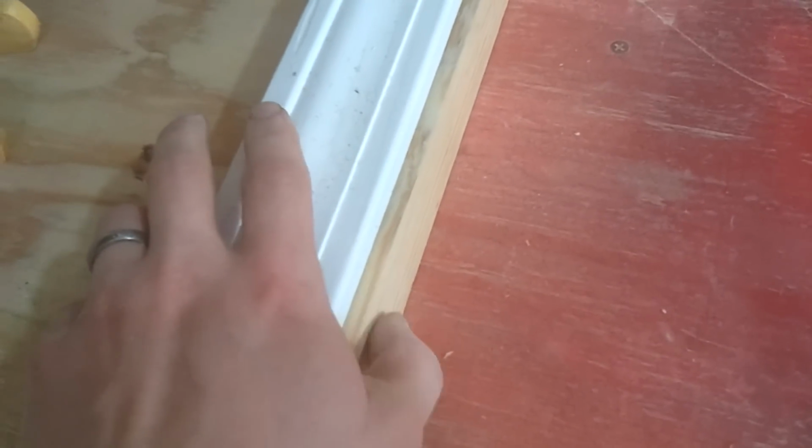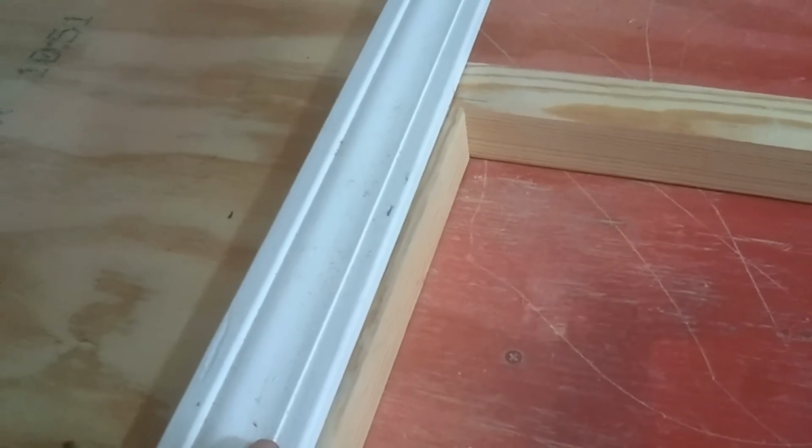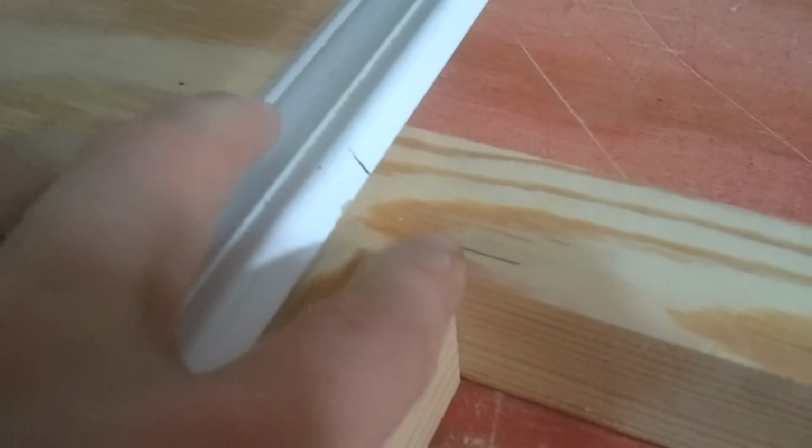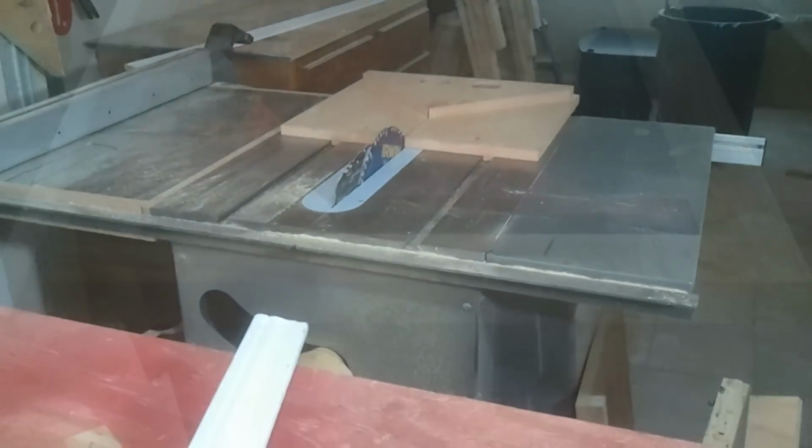And that is because it's going to be difficult to get these perfectly lined up all the way across, on any door rather. So they offset them a little bit, and that'll be cut like so. And my measurement, get out of the light, my measurement is where they intersect. So that's where I need to make a 45 degree angle going away. It's at that location, and to do so, I'm going to use my 45 degree sled on the table saw.